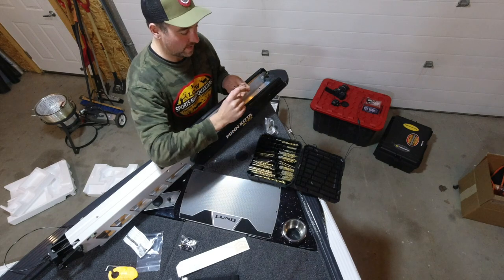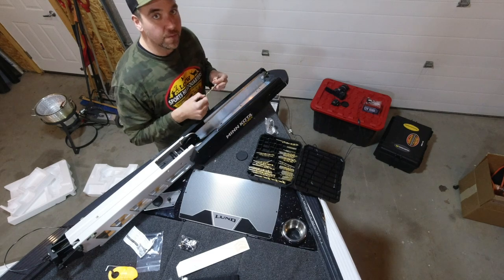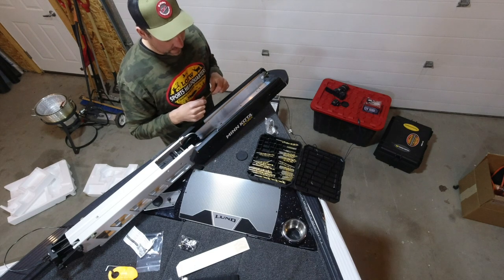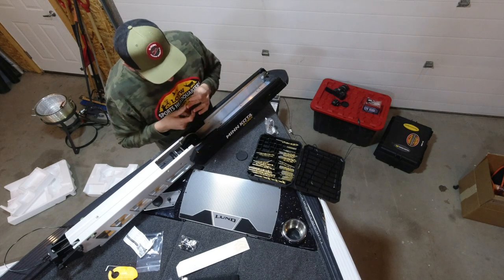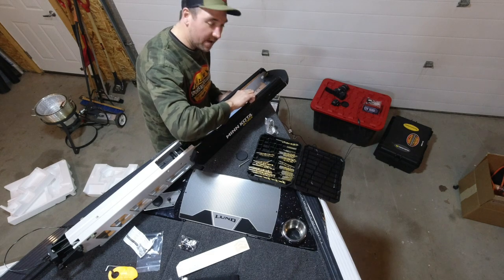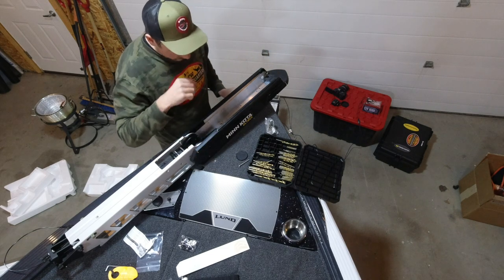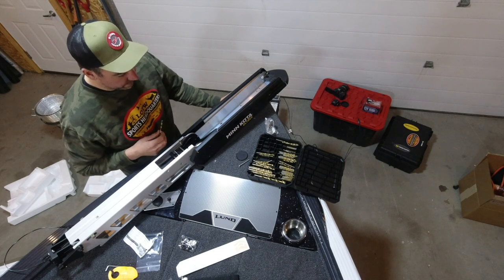You don't want to drill the hole too big — that'll just result in play, the possibility of bolt breakage, and it'll loosen off easier. The way you'll know is when you put it into the hole: if it doesn't freely fit through the pre-drilled factory hole in your trolling motor, then it's too big. So definitely an important thing.